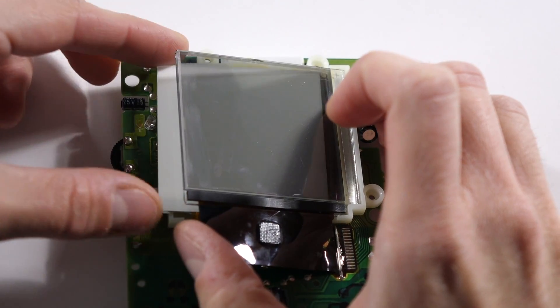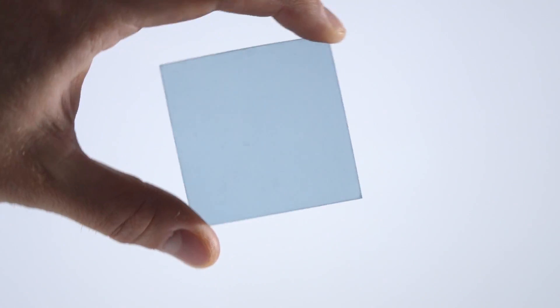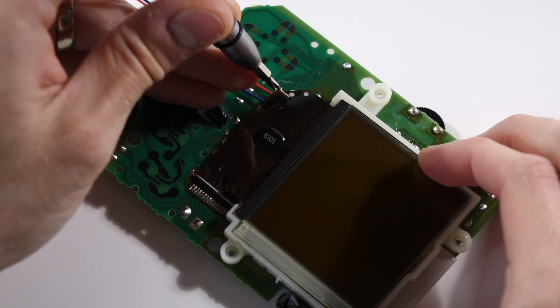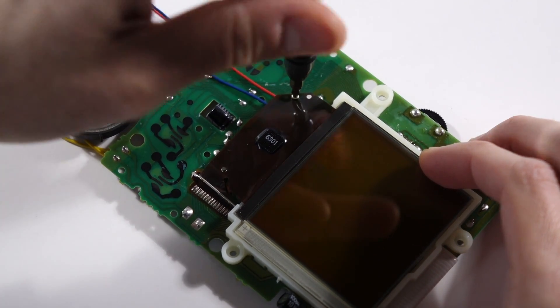Let's get the screen itself finished up. Slide the backlight module behind the LCD panel. The kit also comes with a piece of polarizing film — without it, you won't see anything on the display. It needs to be installed in a specific orientation. The trick I like to use to figure it out is to hold it up to another LCD screen. If you rotate the film, you'll see it go from clear to dark — you want to install it so it appears dark. Peel the film off both sides of the polarizer and carefully slide it between the LCD and backlight. Then, to help keep everything in place, reinstall those two small screws that go through the display ribbon cable.